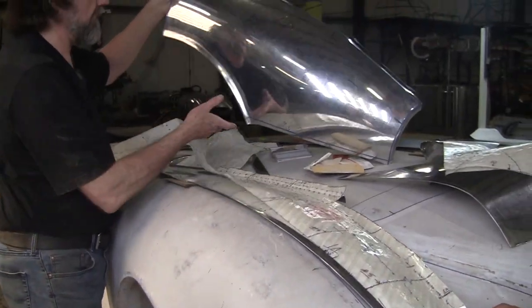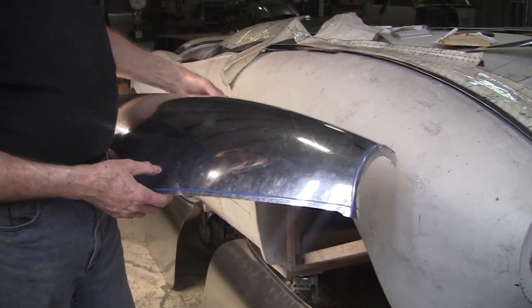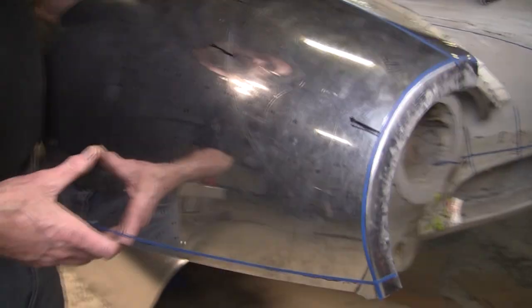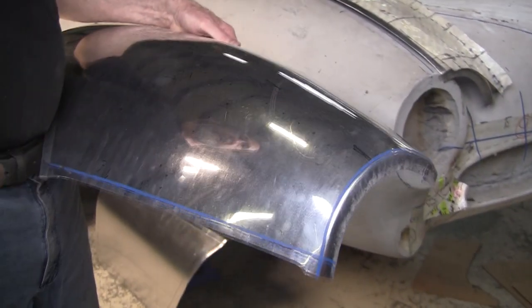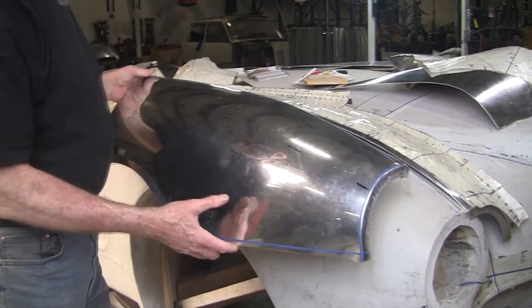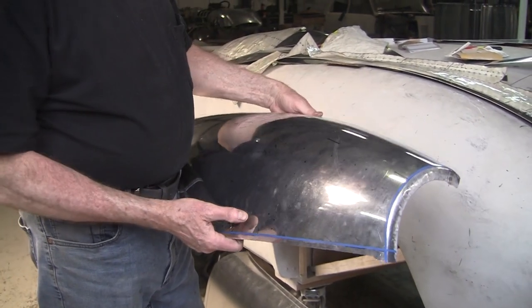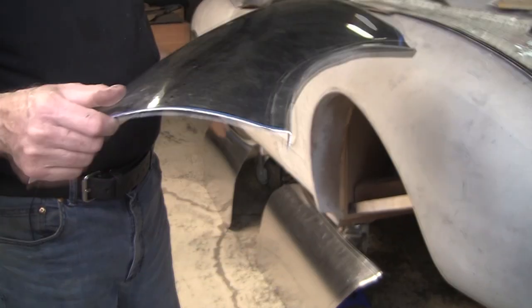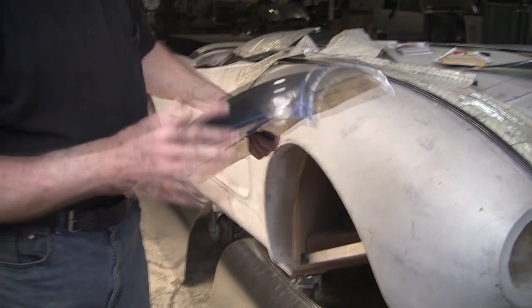This next panel was made by Mike from Ohio. I started it off showing shrinking techniques. This is the thumbnail die — you can see we only did it in a little section, and there's still a little residue. I used my power hammer with the thumbnail die and those cleaned up really nice. The shrinks made in my shrinking facilitator go completely away, which I really like, and they're not hard to do at all. Mike and Ed finished it up by knocking down some shrinks, expanding it a little, and then wheeling it smooth.